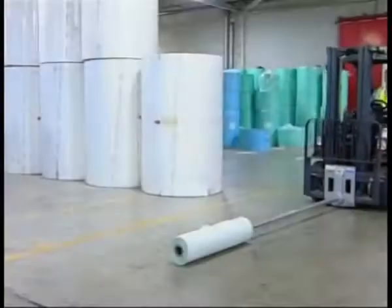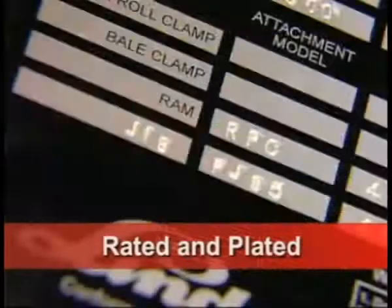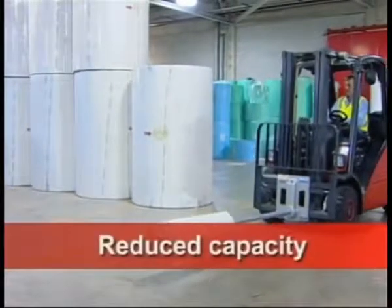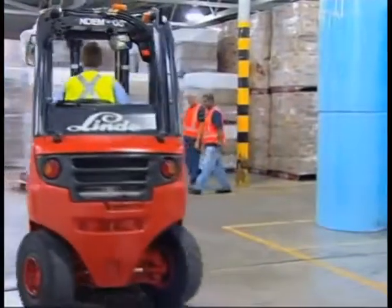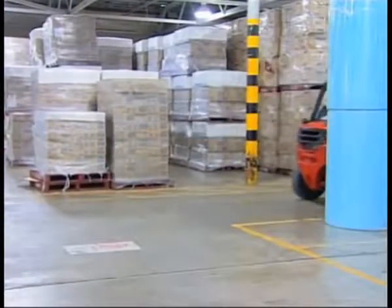The spike must have an approved capacity and the plate on the forklift must be stamped. Bear in mind that the long load centre distance will reduce the forklift's capacity. Make all turns slowly and drive extremely carefully around other people, and never lift loads over their heads.